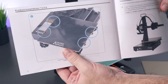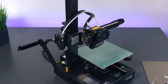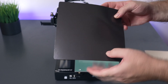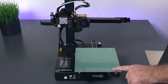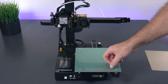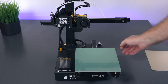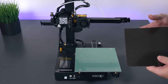For the next part we need to install the build plate. The manual shows the glass option but we have the PEI sheet. Separating them apart we can see the magnetic part - it's like a big sticker that we peel and put on the aluminum heated bed. There is a little protector on there and you can choose to take it off or leave it. If it's flat and in good condition you can leave it, but if you have wrinkles or peeling you should take it off.